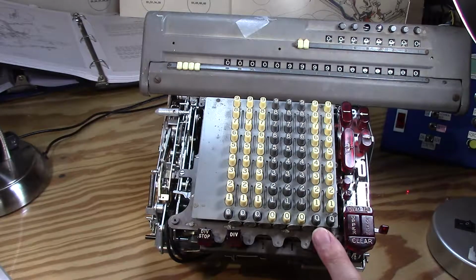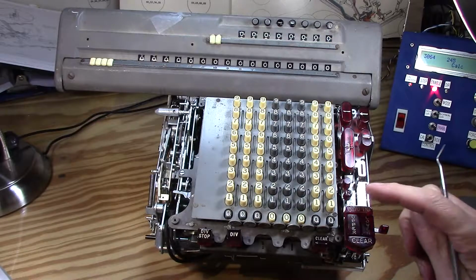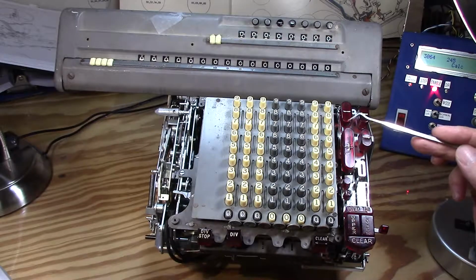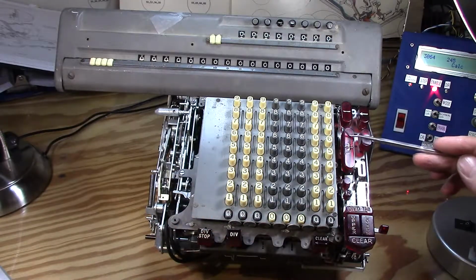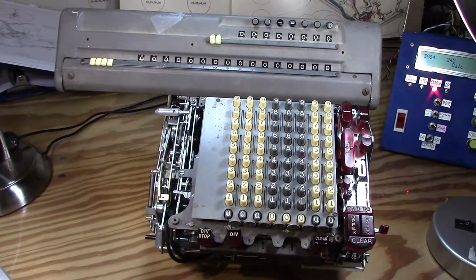So this took a lot more than I would have thought. I had hoped to just simply do a ta-da, I have this thing going here, and show that everything else is running fine, which up to that point it was, until I finally was able to work with divide tab instead of having to hand crank this stuff. And once you have this motorized, you start seeing other little details like this. Basically, the end synopsis is I had to adjust a couple of screws that biased which direction these guys will operate their mechanism that then ultimately goes to the clutch arm, because this guy wouldn't pull down quite as firmly. And then I had to basically just nudge a spring and do some cleaning, and that took quite a few hours of work.